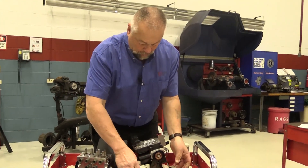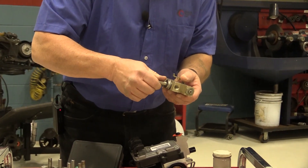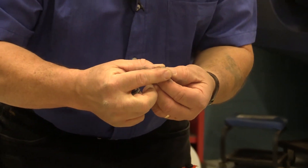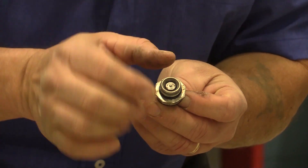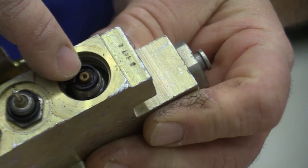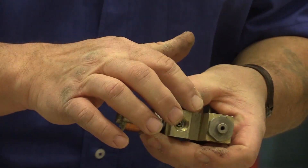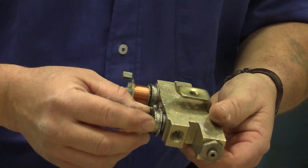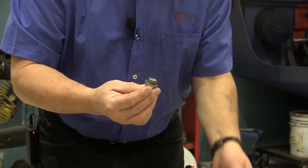This was an easy one to take apart. If you unscrew this, right here is the dump valve. The little valve just sits right in here, and that little tip goes against this small opening right here — that's exactly how it opens and closes. In this case it opens and closes the accumulator, and that open and close cycle happens about 10 times a second, so it really needs to be clean with no debris.